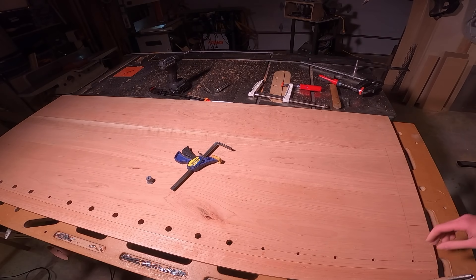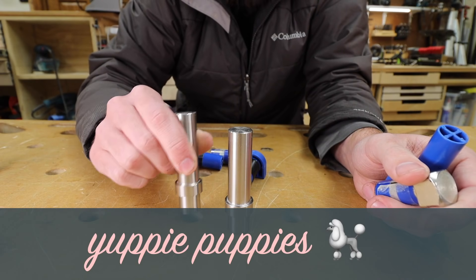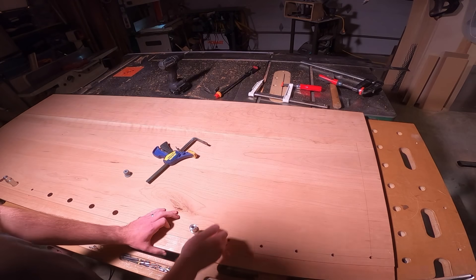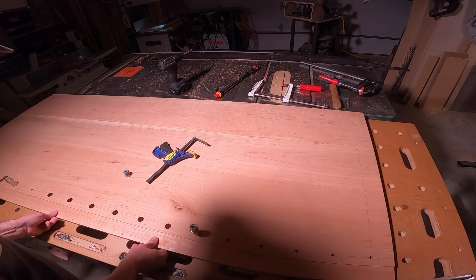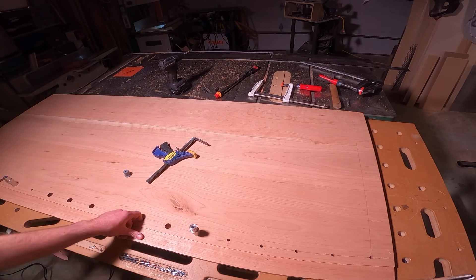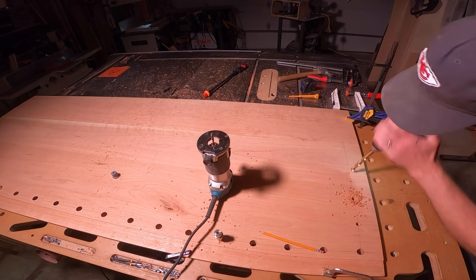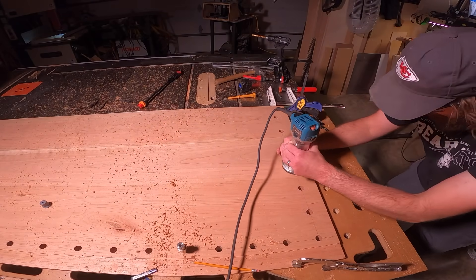Since the MF slab wasn't wide enough for my desktop, I had to do a little shift, and the yuppie puppies — the tall ones — came in really handy for that. If you don't have an MF slab or Festool MFT to use as a template, just buy a 20mm drill bit, center-punch your hole locations, and drill the holes. For a desktop, I don't think a precise layout is really all that important, unless you're designing attachments that will span multiple holes.